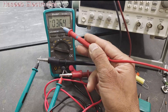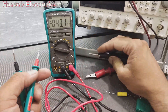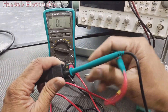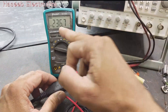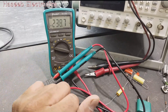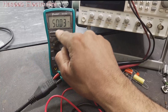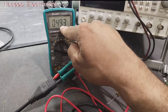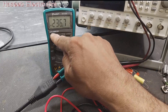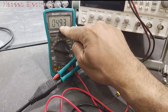At this range it will read up to 600 volts. To measure AC voltage, just press the AC function and insert the leads — it is giving 236 volts. If you press back to DC mode it will not measure AC there. Pressing the frequency button gives 50 hertz. Pressing again shows the duty cycle: 49.3 percent. So at the same point we can check both frequency (50 Hz) and duty cycle (49.3%).